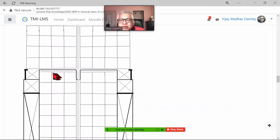Then when you close this hatch cover, these are pontoons, okay? You walk here. This is the area on deck. Your containers are on top of you. You walk under. Okay, they're stored, so they are not going to fall down. And these are called container stools. You know, the bulwark. Just next to the bulwark, there are strong fittings to take the load of the containers. They will be the same height as the hatch cover when it is closed. Same height. They are called container stools.